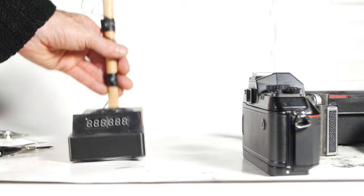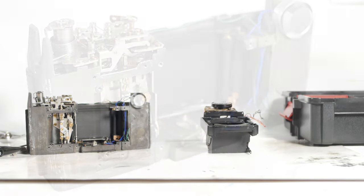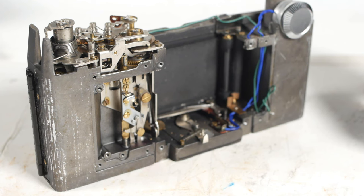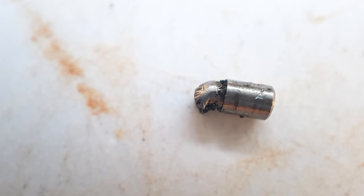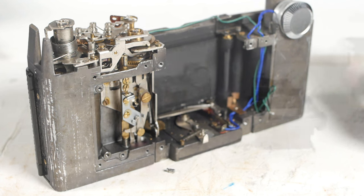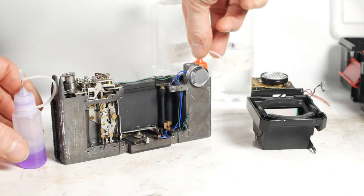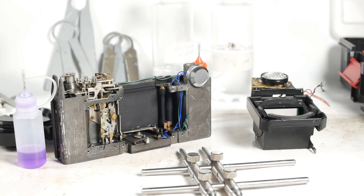And that's more or less it — there will be other tools I use, but it'll just be stuff I already have around the place. I'd better get back to working on the Petri now. Hopefully I'll do a video showing this camera in action sometime, but at the moment it isn't very well — the grease in the winding mechanism has gone solid, and someone has tried forcing it, breaking off a pin from the winding gear. That gear is right down under everything, so a lot has to come off, and success will depend on whether I can make and stake in place a suitable replacement pin. Anyway, if you've enjoyed watching, please like the video, subscribe, and click the bell icon for notifications.